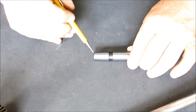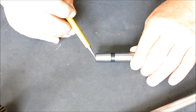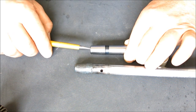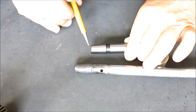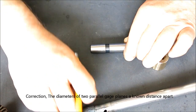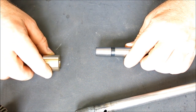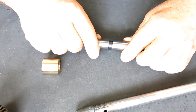The problem is that setting the angle is relatively easy, but the trick is getting the diameters correct. If you don't have your angle right, you need two points. A taper is typically defined as the diameter between two parallel planes — and that's a good way to measure and qualify a taper. We're going to create two planes a measured distance apart, and from that we can extrapolate both the angle and the diameters at any point we care to look at.